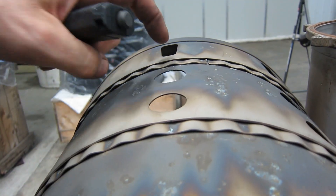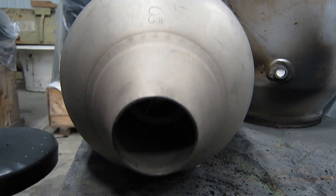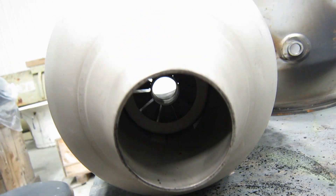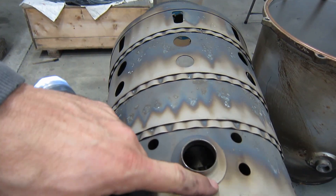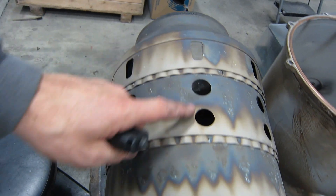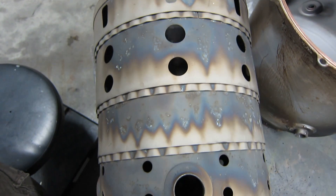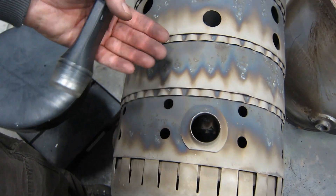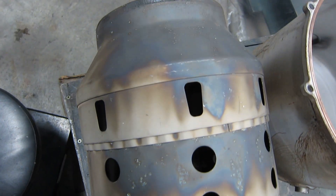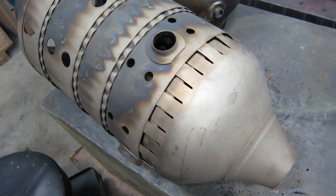Larger amounts come in through these mixing holes, and they cool the burning gases to a temperature that the turbine can handle. Only this much air goes in through the swirlers in the primary combustion zone. More air for combustion travels through this first strip, and these are for mixing. You can see that the discoloration is from a lot of heat - there's a lot of fire in there. The design of combustors is never perfect, and that's why they wear out. We're trying to control a huge amount of flame and keep it - by blowing air on it - from touching the inside of the liner. When the flame does touch the metal on the inside, it heats up. This thing, I'm sure, gets red hot when it's in service now and again. Ideally it would never be touched by the flame, but it does.